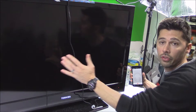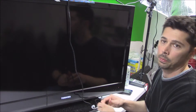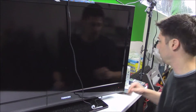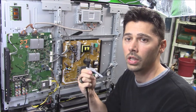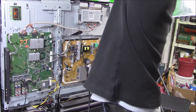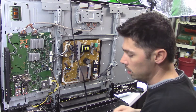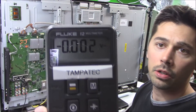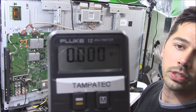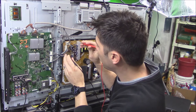You can hear audio, just no video — no screen or brightness whatsoever. By the way, if you don't get any audio, it's probably because you need to change your input. Always use caution when working with a plugged-in TV — you can get shocked. Turn your meter to DC volts, which is a V with a straight line. The TV is on right now.